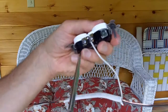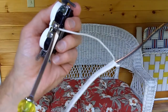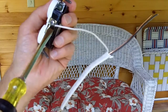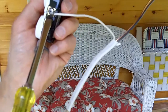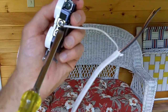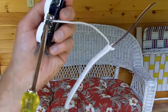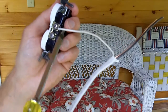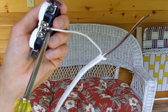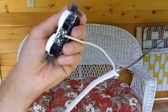Notice also the proper amount of insulation that I stripped off. You don't want any extra bare copper hanging out, and just as importantly, you don't want any insulation to end up underneath that screw. You want nothing under the screw but bare copper wire. If you didn't strip off enough insulation, you could end up with white insulation underneath that screw, which would not give you a good connection. If you stripped off too much, you'd have extra bare copper hanging off the back side. So it's important to get the wire stripped to the right length.